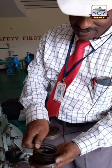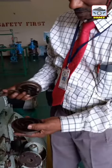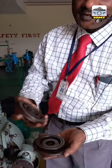Below the valve plate we have got springs. The springs keep these valves in a closed position, but when the pressure inside the cylinder goes down, it opens automatically and admits the air inside.